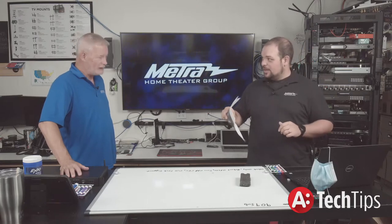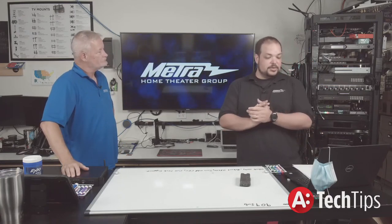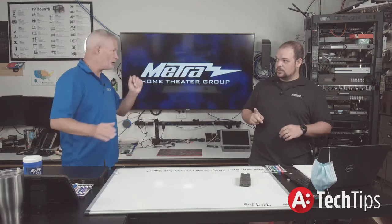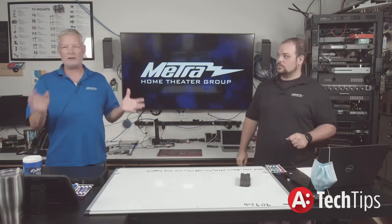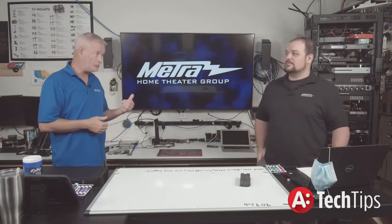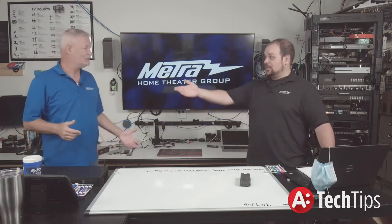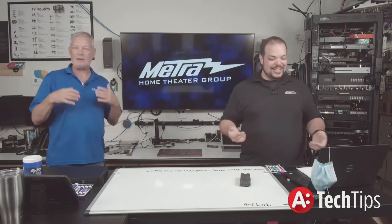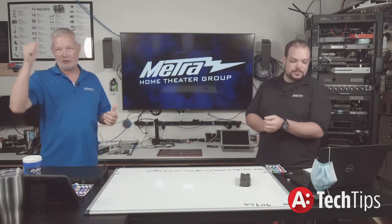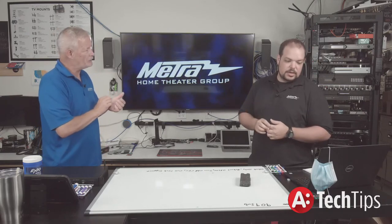Feitonia is asking about our opinion on a CyberPower UPS system — a 30-amp input with four 20-amp circuits out. First off, 30 amps is awesome because it gives you a tremendous amount of flexibility in the rack. The drawback is that you very seldomly are going to have a 30-amp receptacle at your rack unless you got involved at the very beginning of the installation. And having four 20-amp circuits — are they individually circuit-breaker protected? I don't know that product. So how are you supporting four 20-amp circuits on a 30-amp input?